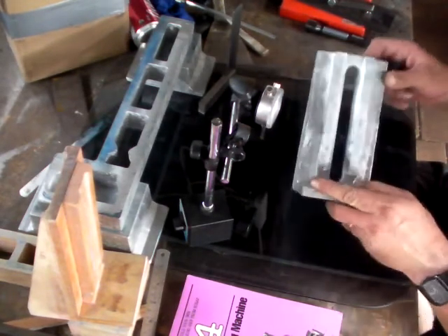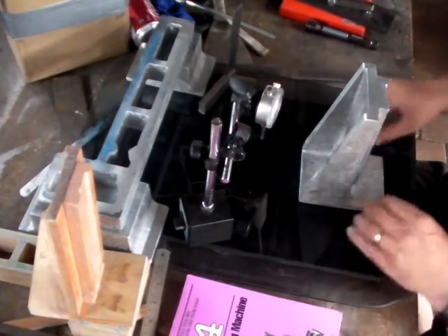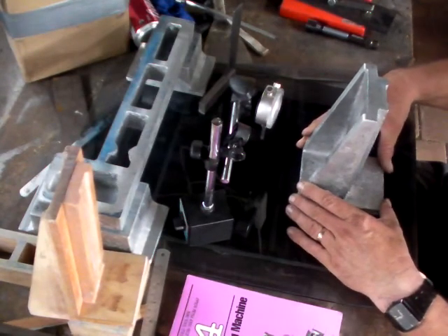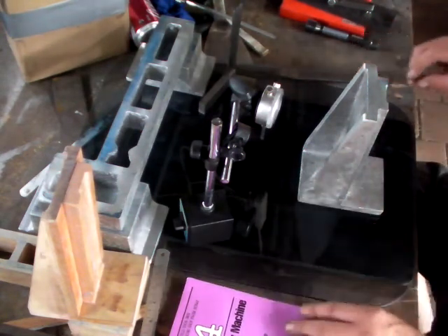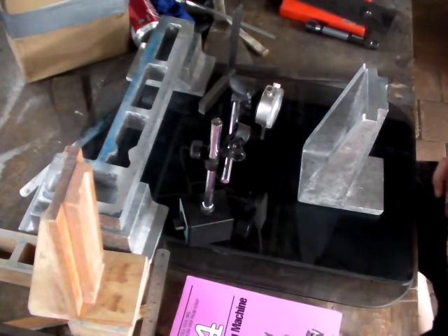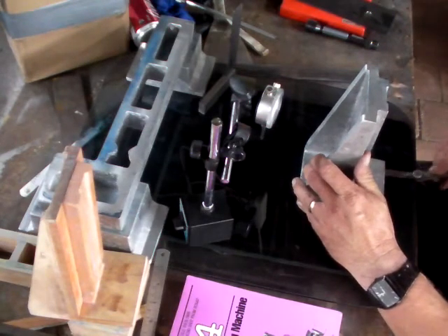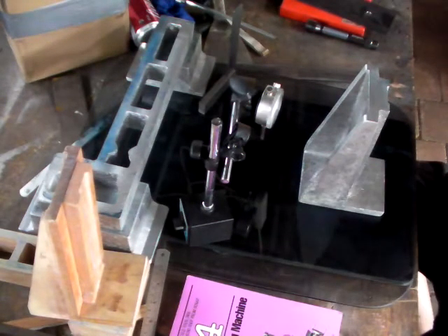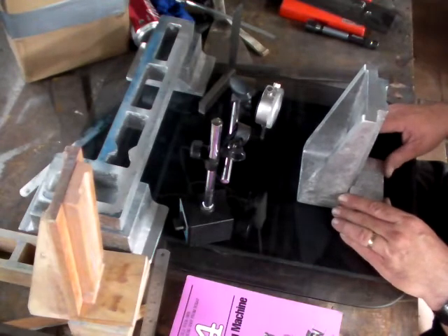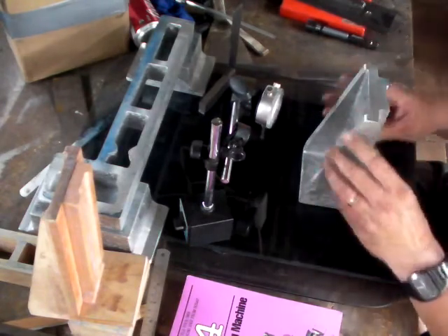The accuracy — if it's a little bit out, you still have the bolt holes here that you can adjust. On the final assembly, if required — preferably you wouldn't want to — but you could shim these up off the bed. But for me, that will be a last resort. I will assemble it, re-check it once it's assembled, and if need be I'll go back and work the base or work these ways.